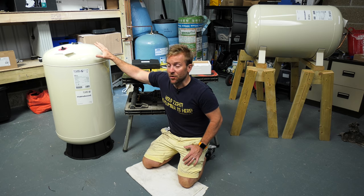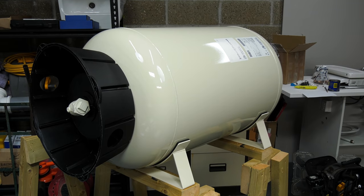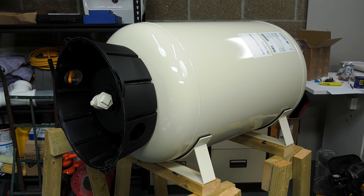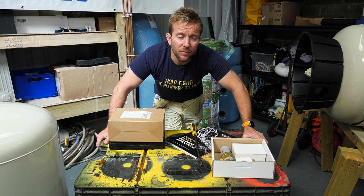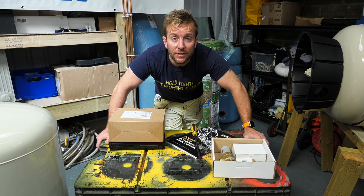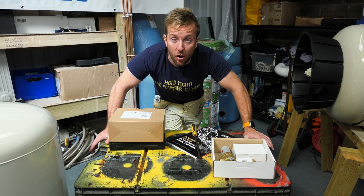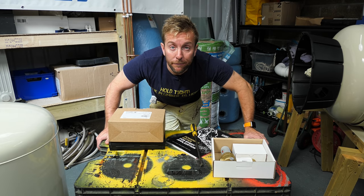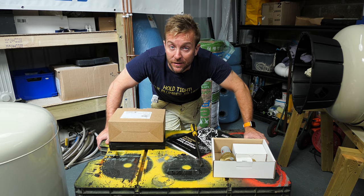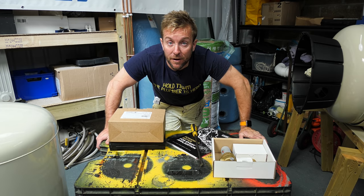What we're doing is gathering water, gathering flow, gathering pressure — all locked and loaded, ready to be released into the system when you open a tap. The vessels can be installed in vertical or horizontal configuration. When installing one of these mains boosts, we need to think about system protections: we don't want too much water pressure, so we need a pressure regulating valve. We also need a non-return valve to stop gathered pressure going back into the mains. It also helps to have a couple of pressure gauges so we can see what's going on.